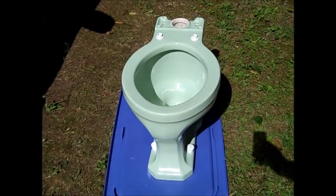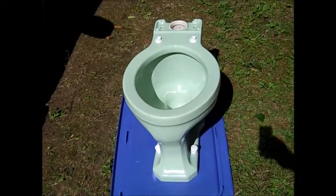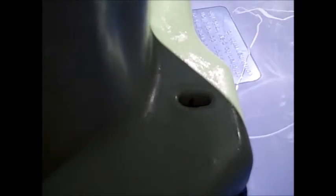The numbers 78 space 4 are stamped in the bowl and the date of manufacture was November 25th, 1954. I've turned the bowl right side up and now we're going to have a look inside the entrance. Here you can see the jet passageway and a plug down here — it was probably to drill a hole for the jet opening on the other side. Look inside the opening here and look how the water drops in and drops onto what looks like a little bit of a shelf with a small round hole drilled into the middle of it. That is the entrance to the jet.